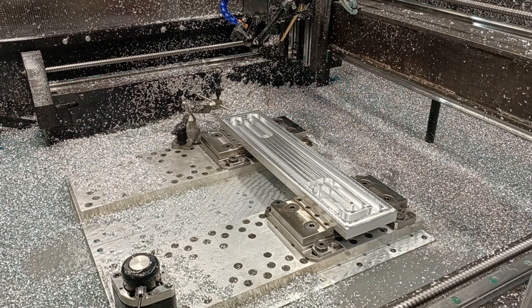Here is the risky part - not the slot, but the fact that it's an eighth-inch end mill. You don't really get any warnings before it snaps. With a bigger end mill you'll hear it and be able to react and a lot of times compensate. If you're off on small end mills like this, they just snap. There's no warning - it just goes tick and it's gone. That's a risk with the smaller end mills.